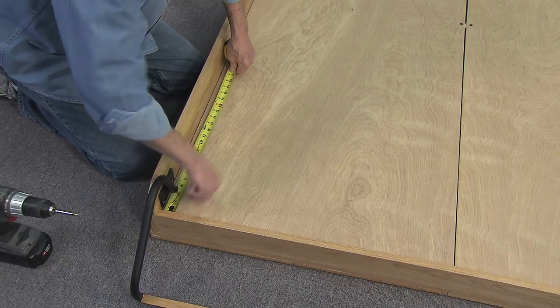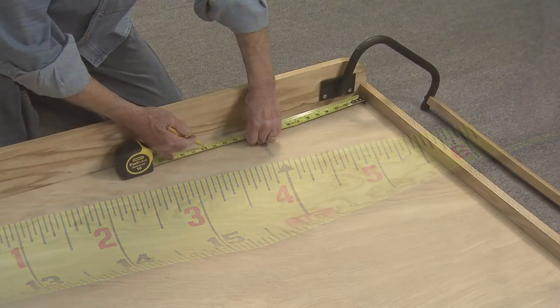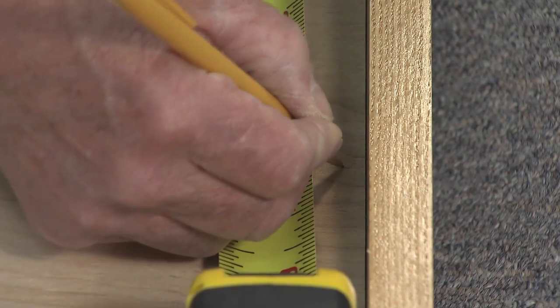Screw the ends of both mattress retaining straps through the 1/4-inch plywood support pieces into the inner wood bed frame 16 inches from the front corners of the face panel as shown in the purple assembly booklet.